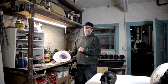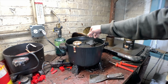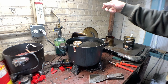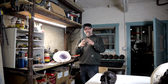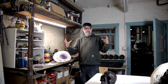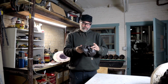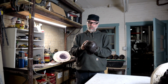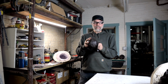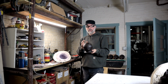The wax we're going to be using this evening is a microcrystalline wax, which is most known for specifically foundry, or at least in art casting realms. Part of the reason we like it is that it has a wide temperature range, and so when we first start off at room temperature here, it's stiff enough that it actually holds a nice surface, and it's not inherently sticky. It's about 70 degrees in here.